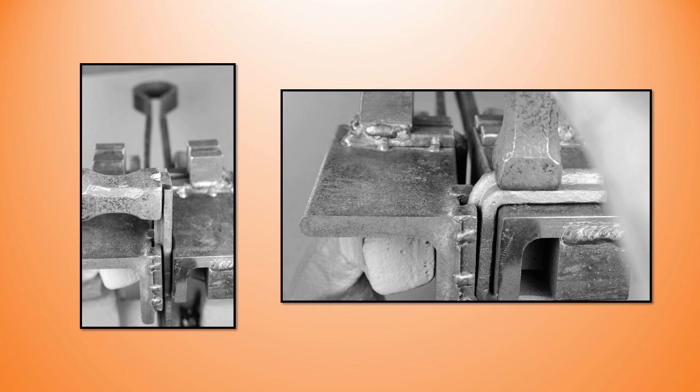And in these pictures, I'm showing my first bend of the collaring stock. There are a couple of things to note here. First, there's a center punch mark on the edge of the collar material, and that suggests that there's going to be some form of math later on, and yes, you're right. And secondly, I have relieved the edge of the angle iron to match the chamfered edges on your scroll work, and that's going to help with the fit of the collar later.